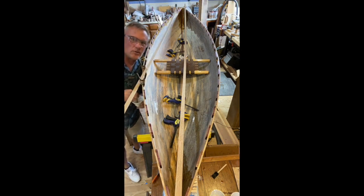All right, so I'm going to cheat a little bit. I have some 207 hardener, which is a slow set. No, pardon me. The 207 is the extra clear. The 206 is a slower hardener on that. So because of our temperatures right now, low humidity, I'm going to go ahead and run with the 206 to get a little bit more time to work with this just in case. But hopefully that'll all turn out well. And that's from my other skin-on-frame canoe that we did. We didn't need clarity. So let's give this a shot. This is going to go all along the inside edge, and then we're going to clamp that down onto the gunwale side. So here we go.